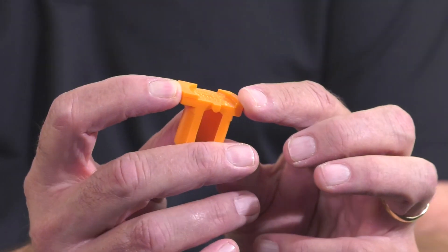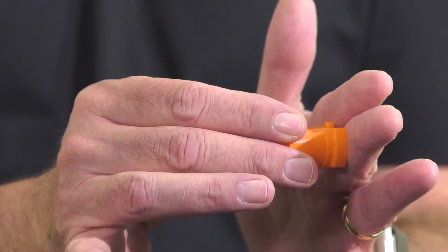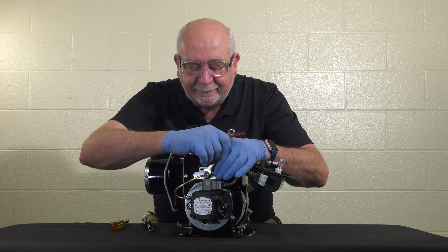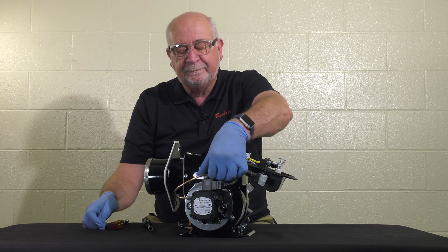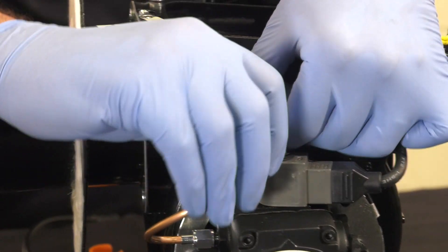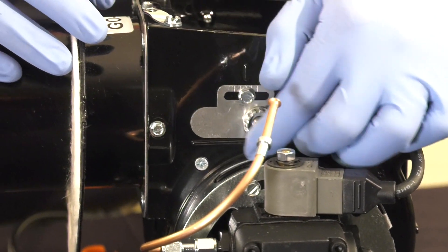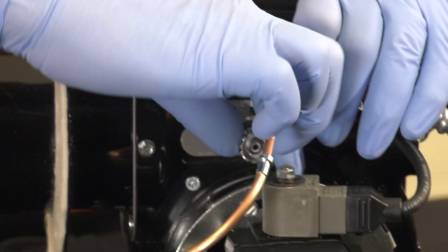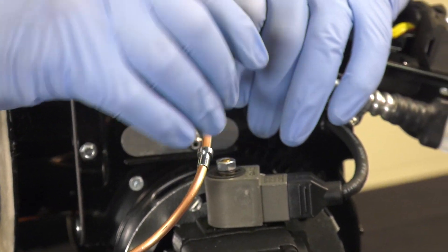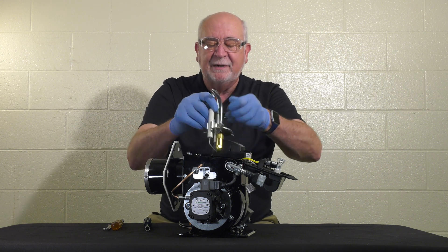The other two tabs are going to slide forward and hit the back of the head, giving you the Z dimension for an F head. To begin, loosen and remove the nozzle connector line from the bulkhead fitting, then loosen and remove the spline nut. Place it over the nozzle connector line so we don't lose it, then reach in and pull the nozzle line assembly out.